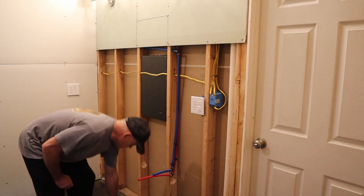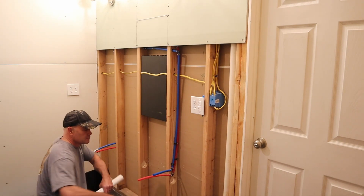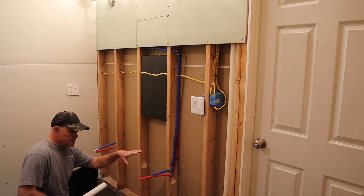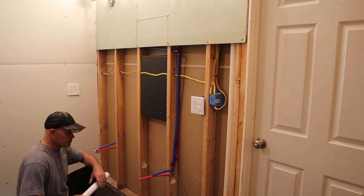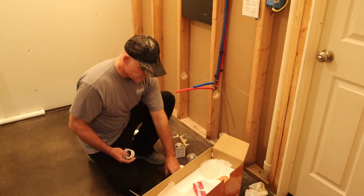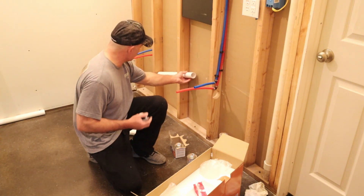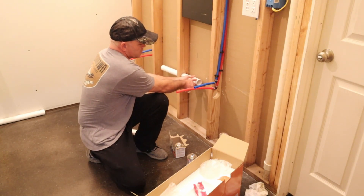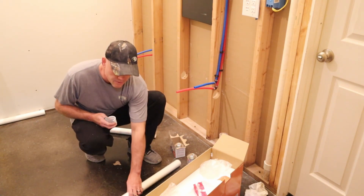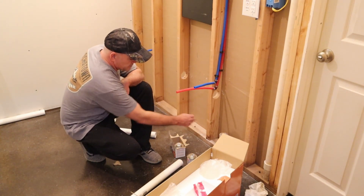The first thing I want to do is go through and I have to have a drain pipe right here, or a drain where it comes through the sheetrock under the sink right here. And then I have to have one right here. I'm going to go ahead and measure all that out and cut all the pipe. That way I can fit it in here, test it, make sure it's at the right size, and then I'll glue it all in. This piece here I already cut. It's going here to connect to this drain over here. Now I just want to go ahead and glue this piece in - the extension or the coupling - on that end so I can measure out the size I need going over here into the drain.